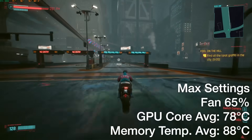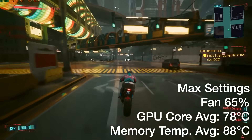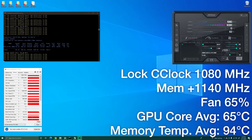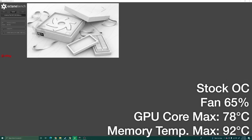So let's establish some benchmarks. From a gaming standpoint, Cyberpunk 2077 ran the memory at a cool 88 degrees Celsius. As for Ethereum mining, a one-hour mining session yielded temps of 94 degrees Celsius, which is not terrible, but there's definitely some room for improvement. Finally, an all-GPU load running Octane Bench yielded a max GPU temperature of 78 degrees Celsius and 92 degrees Celsius on the memory. We'll use all three of these measurements as a benchmark for this mod — so let's get modding.